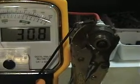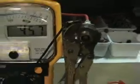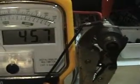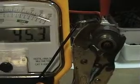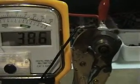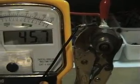If I reduce the voltage by just one volt, the event will pretty much stop. Now I'll stop it and show you what happens once I attach this diode string — I've got 16 1N5404s in a string here. I'll change nothing else. It's exactly the same setup. Once I start it up with the string attached, there is no high voltage spark event.